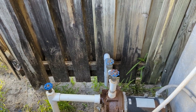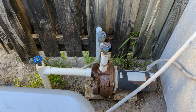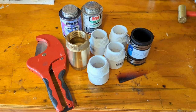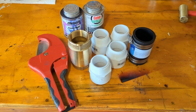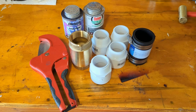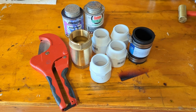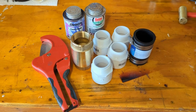I think this thing lost prime — just spitting. So if your sprinkler pump is doing that, odds are you need to replace your check valve, which is this piece right here. I'll leave links to all this stuff in the description, namely the check valve. But I'm going to be doing something a little bit different: I'm going to be plumbing in a flexible coupling right there that can be used to remove the pickup from the canal easily without cutting the line. So let's get into the repair.